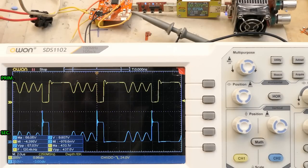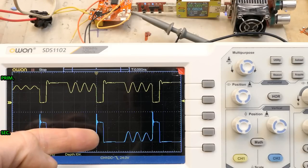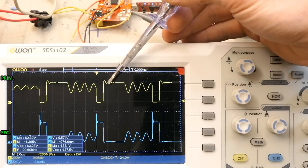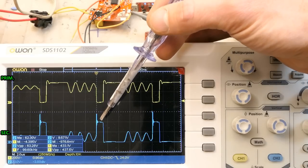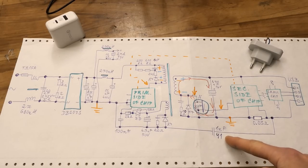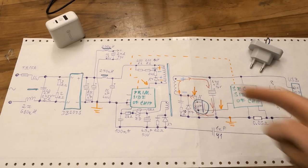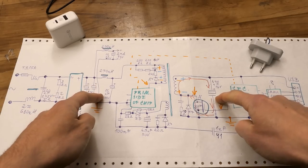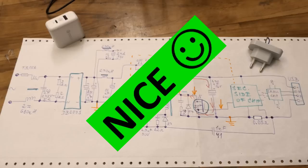People depend on technology they can't understand, make, or fix themselves. It's not even made to be fixable and the only ones who can make it are at least several thousand kilometers away. Back to the primary and secondary winding - the waveforms are similar, other than the different positions of the overshoots: the primary has an overshoot when the primary transistor turns off, and the secondary has an overshoot when it turns on. This charger has a proper fuse, a lot of interference suppression, real current capability, a snubber network, huge isolation distance on the board, safety-class capacitors, multiple layers of thick safety insulation on the secondary, higher efficiency because of the synchronous rectifier, and it runs cooler which also helps the electrolytic capacitors last longer. So the conclusion is: nice.